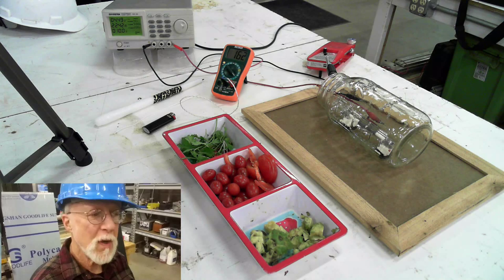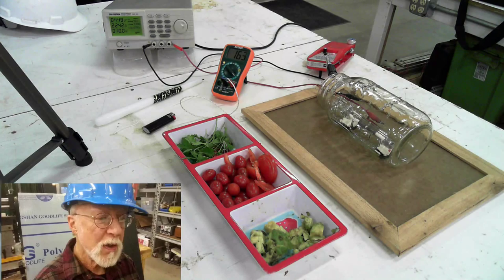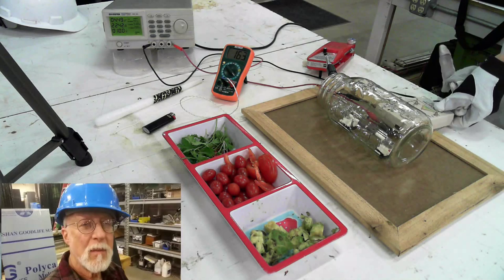It's going to keep coming out until all of the hydrogen has been released, which means you can build up very high pressures. And Parkhomov discussed this, and he calculated that we could expect pressures of up to 1,000 psi, maybe even higher. He said 100 atmospheres. And we actually saw 35 atmospheres in our first test. Yeah, and that corresponds to about 500 psi. That's a lot of pressure.